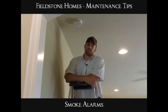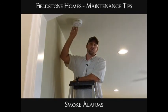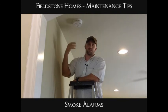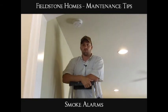Another thing you want to test is the actual functioning of the smoke alarm. There's a test button on all smoke alarms right here — you hold it down for about three seconds and it'll beep. The whole house should beep because they're all hardwired together. That'll let you know if they're working properly. If they're not, you do need to have them serviced.